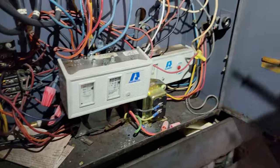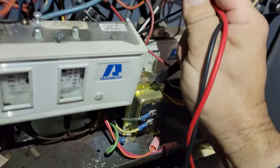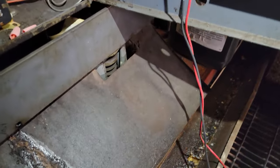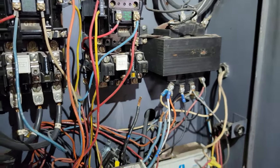Here's our problem. We go to ground — I picked the piece of conduit up here. Let me go to that transformer. On the transformer we got one and a half ohms to ground. I'm going to isolate the motor. I just checked them to ground and it's still a short to ground.